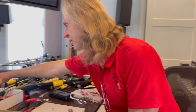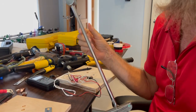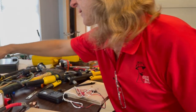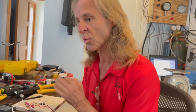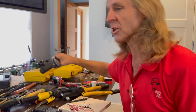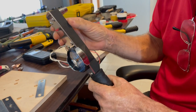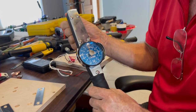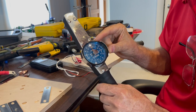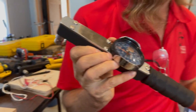It's important that we use the right torque to make our connections. The combiner box required 20 foot-pounds of torque on every one of those lugs. These batteries require 4 to 5 newton-meters to tighten up the lugs. You want to use a much more precise tool that operates in that smaller range — this one uses inch-pounds or newton-meters in very small increments, and that's important for making the joints on the battery.